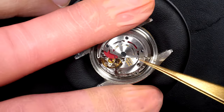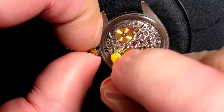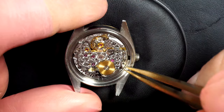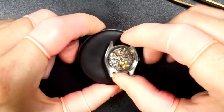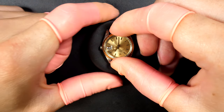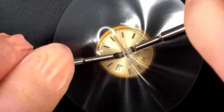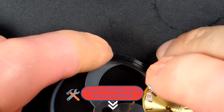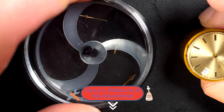Going to start disassembling the watch by removing first the automatic winding system on top of the caliber. Now we should be able to take this very small caliber out of the case by removing the case clamps — the first one and the second one — then turn it over to release the caliber and the dial with its beautiful gold hands, removing them with a pair of levers.